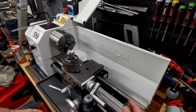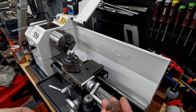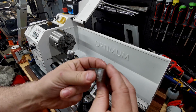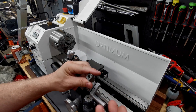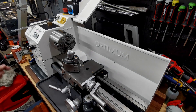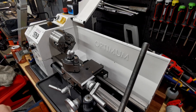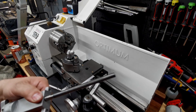After that I started making one of these. I pulled out a piece of steel about the same size and started machining — it was looking good. Then I thought, oh, I can't make it out of steel, can I? Of course not, because it's meant to work on a steel thread, and you can't have steel on steel — it'll wear out in no time.